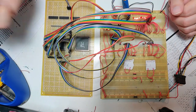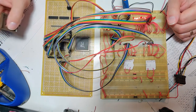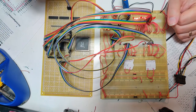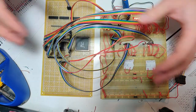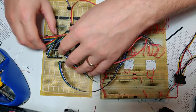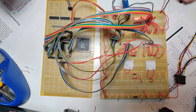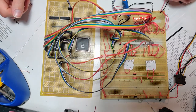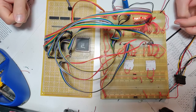If you attach wires first and then tell the CPLD where the signals should go, it can get over-constrained and you can't get the most out of all the resources inside the CPLD. So my plan is to first take the CPLD socket and just get it in the board and tack it in. Then I'll show you my super-hacky CPLD programming situation, whip up some ABEL code — I'll show you what ABEL is too because it's weird — and once the IOs are assigned to the pins the CPLD wants locked down, we can start soldering those connections.